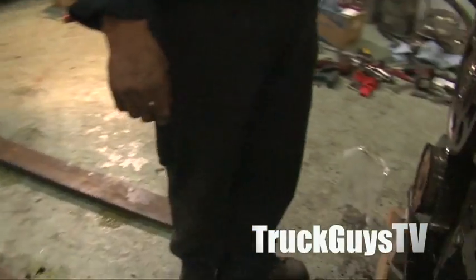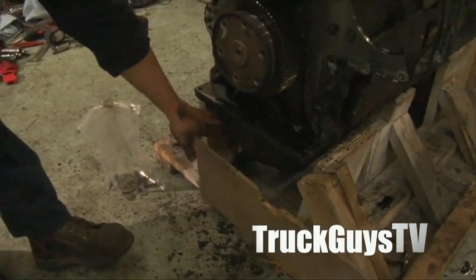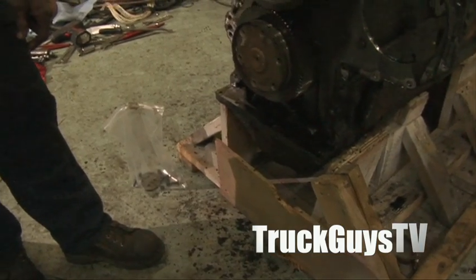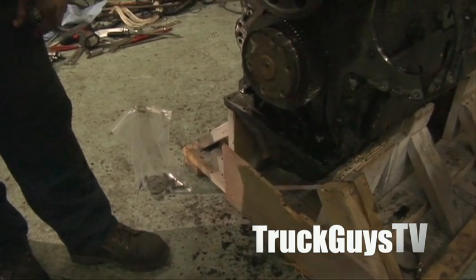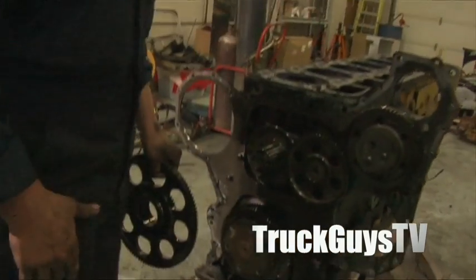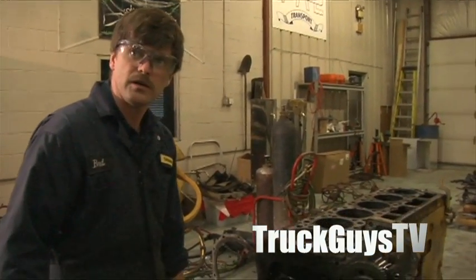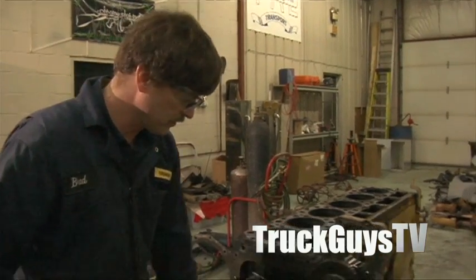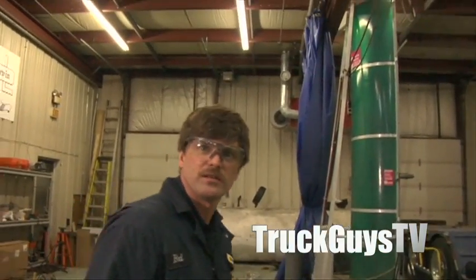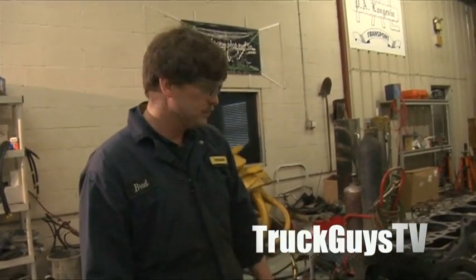So where do you think that bit's gone to? In the oil pan — probably fell right down in the front sump area. Do you think we're going to find it intact or just chewed up? No, it should be all in one piece. Could it potentially cause damage down there? Yep, it could get caught up in the oil pump drive gear. There are magnets in the bottom of the oil pan, so we're hoping it got stuck to one of them. Could have been down there since the last in-frame — we don't know.